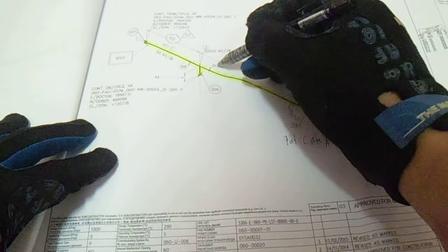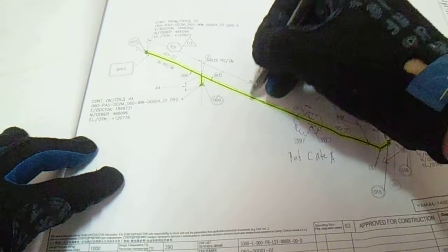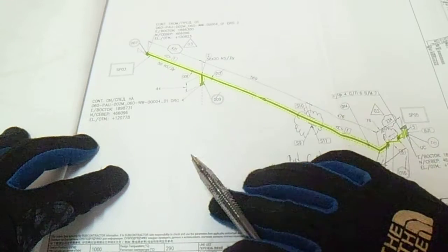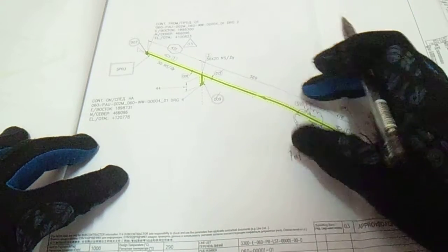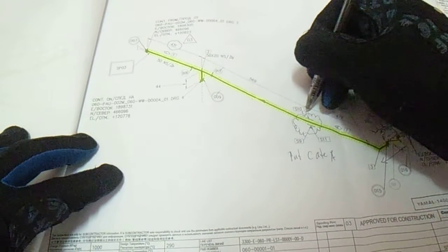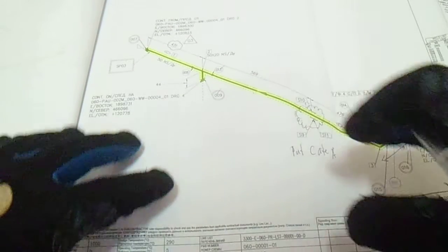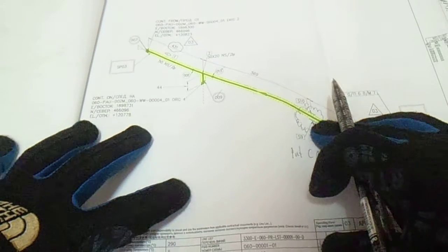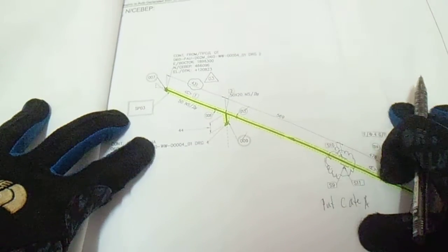So check the joint here, and we have also tracing. So this tracing is category B if not yet installed. If from this support they have a guide, not welded from the pipe, so this is only category B. So only an attachment from the pipe is category A. Okay, this is line checking. How to do line checking? So this is very easy.